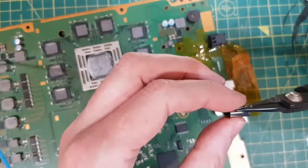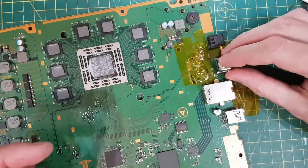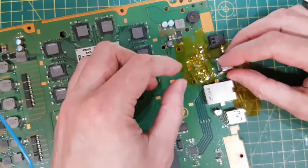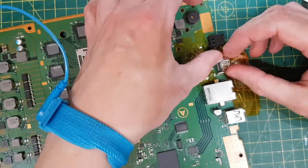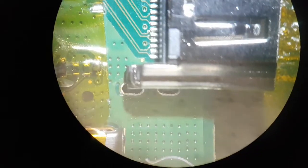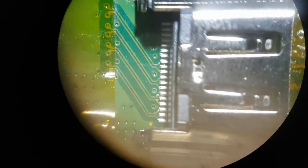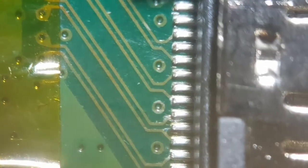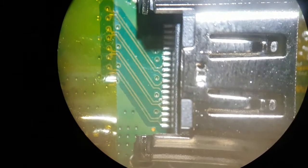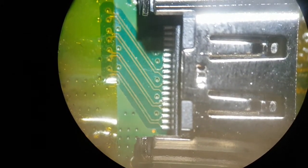Bending out the leg on the opposite side to where I want it to go pushes it along. Now with that bent out — I'll show you under the scope — I've got it much happier with the alignment. Under the scope you can see that just by pushing that leg out I've managed to get the pins to align. I'm going to solder the pins on first, and pushing that leg out has also stopped it wriggling around. So I put a bit of blue tack each side and just solder that in.